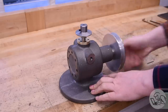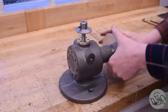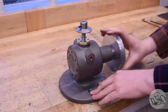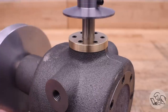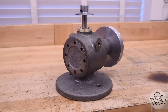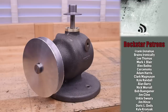Here's a little test drive with all the new parts. You'll notice the ticking noise from the previous video is gone. I did a little tuning — it turned out the slide block inside the yoke was about a thousandth too thick, which was preventing the yoke from sitting on the face of the crankshaft properly, causing it to rock back and forth and make a noise. So everything's running quietly now. Things are a little tighter now that I've tuned up those clearances, so it's going to need a bit of running in. It doesn't freewheel quite as well as it did, but once it runs in it's going to be much quieter than if I'd left it the way it was. Of course there's no oil in anything yet. Really all this thing is missing now is a table, but that is all the time I have for you this week. I hope you enjoyed the making of all these little seals and caps and things — some surprisingly interesting operations in there. Thank you very much for watching, and thanks especially to my patrons who make all of this content possible.